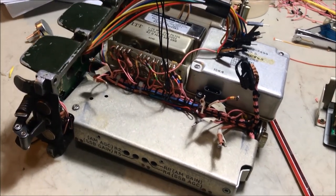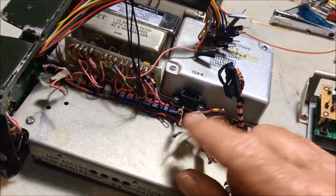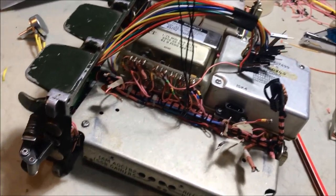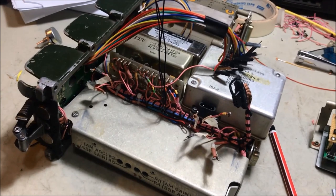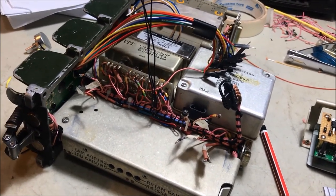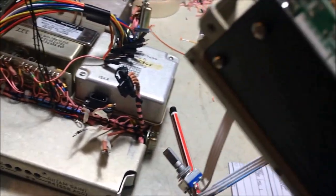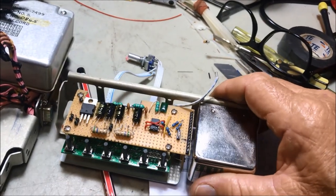The things we do. Okay, so yep, I've tidied up all of the cables along here, and I've left the cables here for the reference oscillator, and I've decided to go with the pre-programmed integrated circuit, with a switching arrangement to switch between upper and lower sideband. And I mentioned this little section that I reserved. You see it tucked in there, in the back there. This little add-on I've put onto the back. And if you look down inside that little hole, there's the chip in there. So I managed to get that chip from a chap in the UK, who supplied it to me.